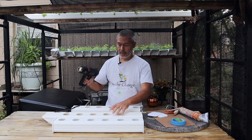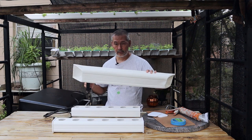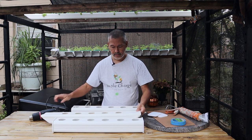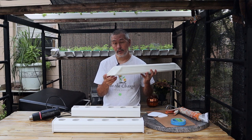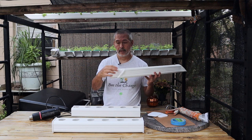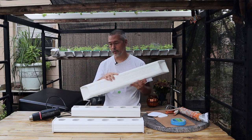It gets really hot — up to 1,100 degrees Fahrenheit — so if you use one of these you have to be careful. It'll peel paint off the side of the house and peel your skin right off your fingers if you're not careful, so wear heat-resistant gloves. Heating up the plastic also lets off toxic fumes, so you always want to do this outdoors — never indoors. Once the PVC is warm enough to bend, you'll need gloves for that too, so there's a little bit of a learning curve.